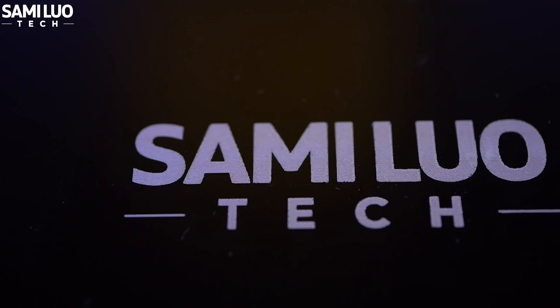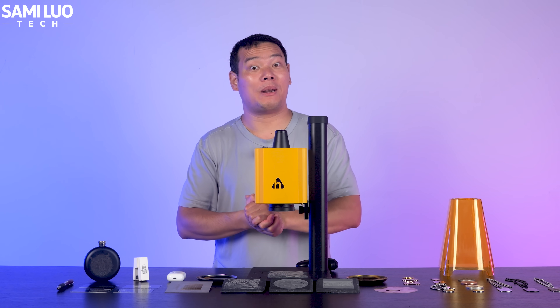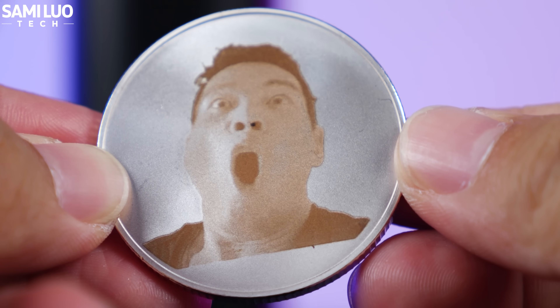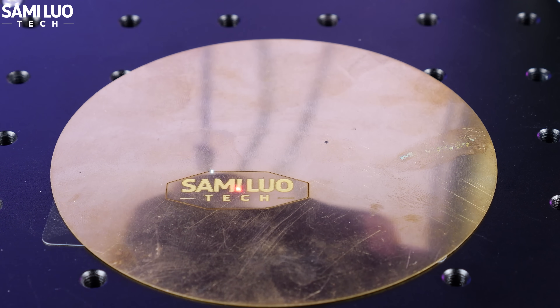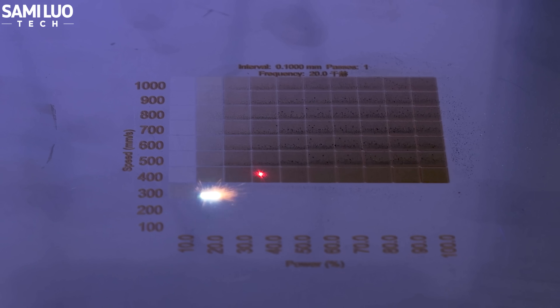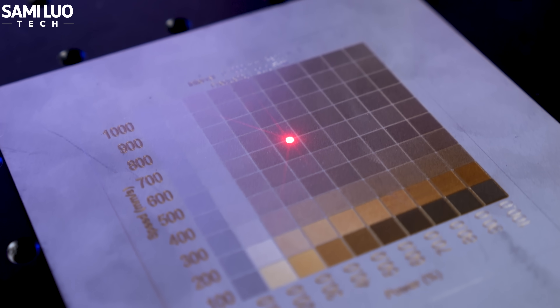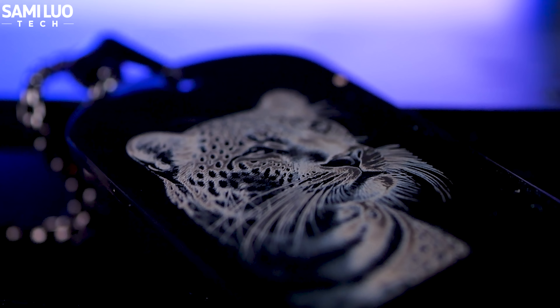The results are super clean, with super sharp edges and no visible jagged lines. That was on a painted aluminum plate. I also engraved my YouTube profile picture onto a metal card — I'm not entirely sure of the exact metal composition, but it handled really well. I even tried multiple passes on a 0.5 mm copper sheet and managed to cut through it without warping the metal. For stainless steel, you can experiment with different speed and power levels to create colorful surface patterns — great for creative projects. Here are more results from various metal engraving tests.